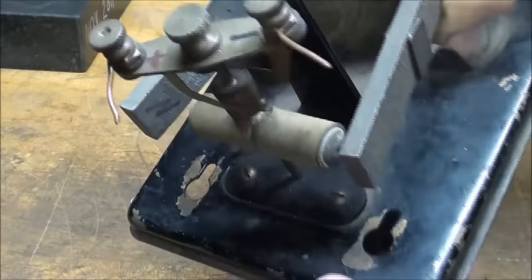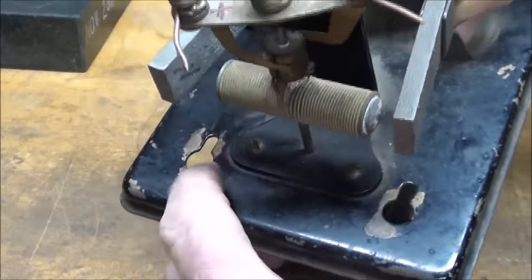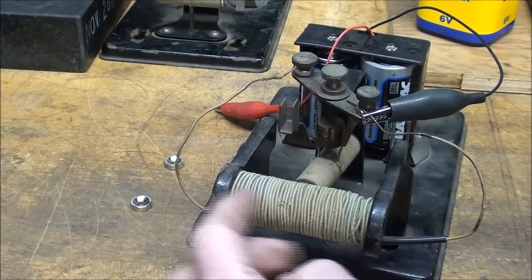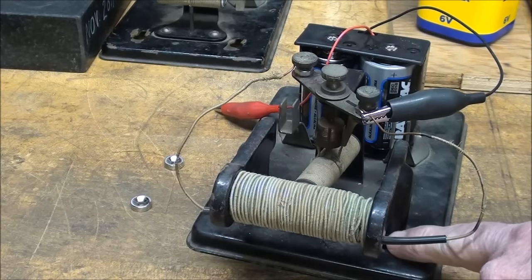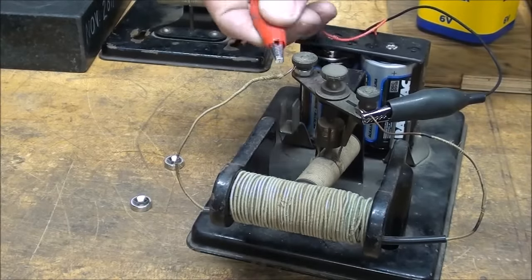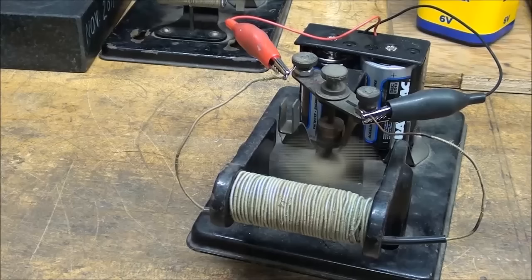These motors came in modular pieces, and you can see that we got some slots here, some keyholes. And if you had this accessory, which was a little bit extra, you could put the field coil here, which is just a wound magnet, into those holes. And this one requires 3 volts to run. And when I hook up the 2 D-cells, you'll see there it goes, and there was enough magnetism to attract those 2 magnets that were lying near it.